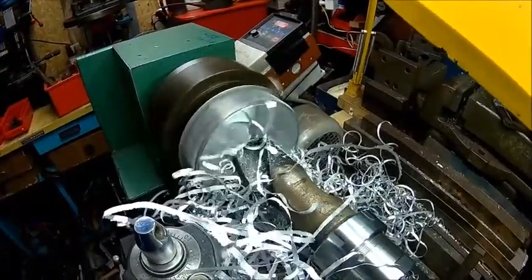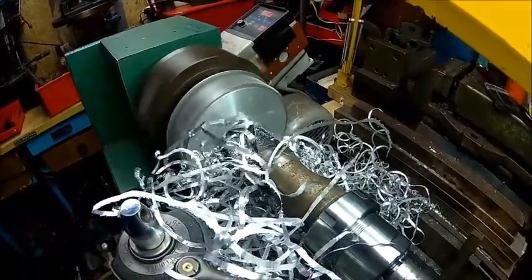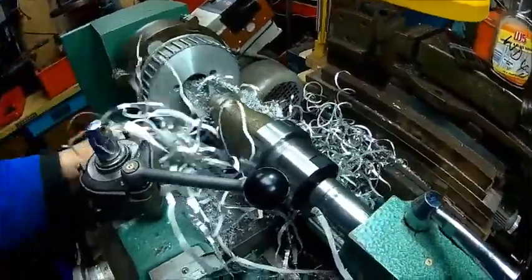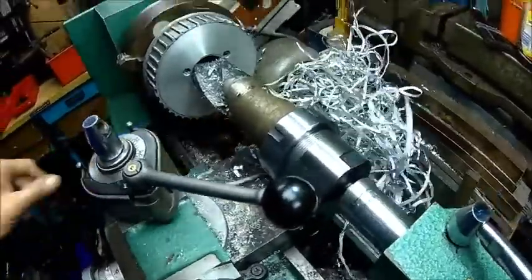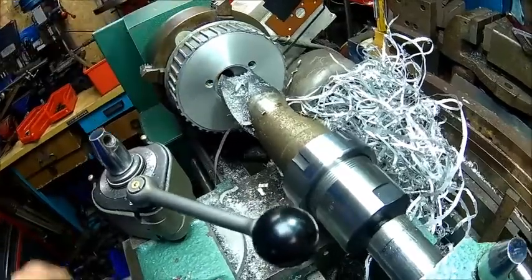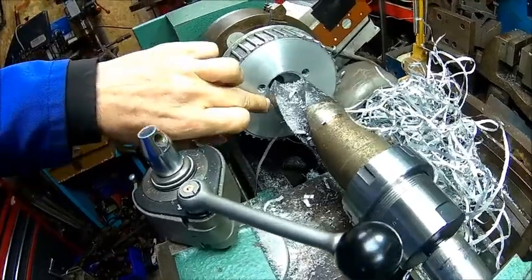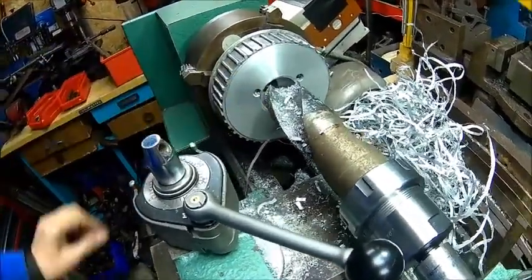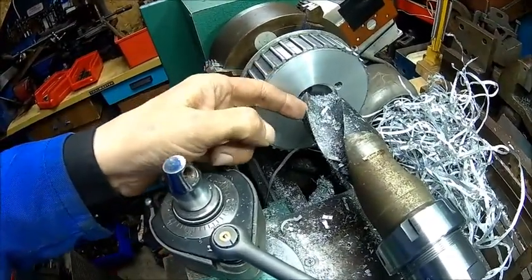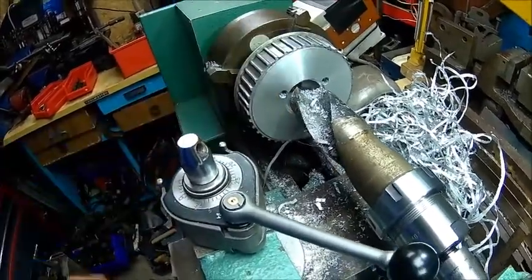Hitting that outer diameter of the drill. It's getting nasty now, but I think this grind doesn't cut very well. It does cut, but not very nice. Anyway, we get what we want. Now we put a lot of heat in. That step here in the drill is not sharp. It's just hogging, basically just displacing material.